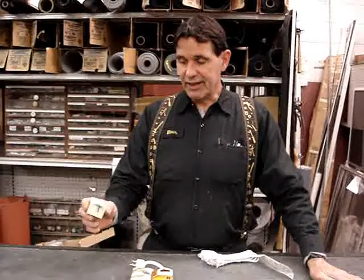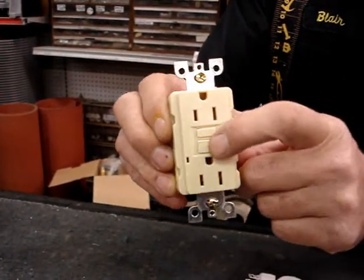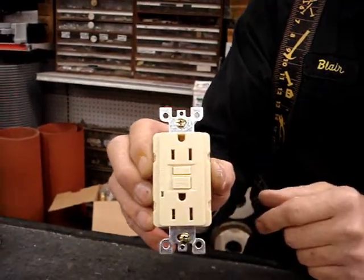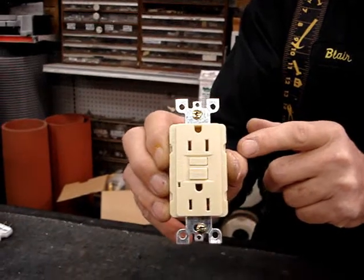When you're out at the side putting in your holiday lights, one thing that's nice to have is the GFCI, or GFI, which stands for a ground fault circuit interrupter, that would be outside of your house. You will know it's a GFCI for a couple of reasons: it will have a test reset button on it, and they're usually always in a square decor frame. But if they don't have that test button on it, it's not a safety receptacle.